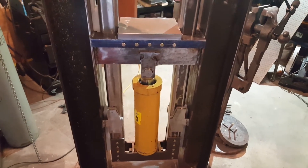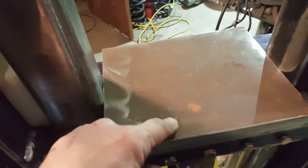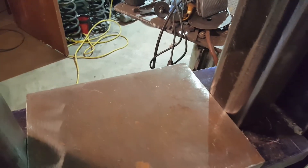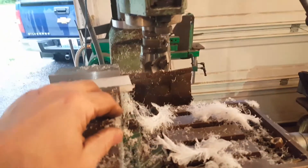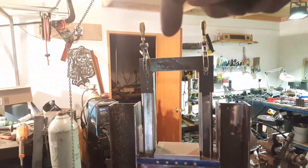You can see when I was moving that carriage up and down, this is exactly 10 inches wide and didn't even move at all — that's the kind of accuracy I was able to get. This is my first major project where I've had access to a milling machine. I had to take some thickness off the UHMW guides to dial them in perfectly, and having the mill and the lathe has really been helpful. The three-inch square tube goes straight through that inch-and-a-half table — a lot of milling, a lot of time.